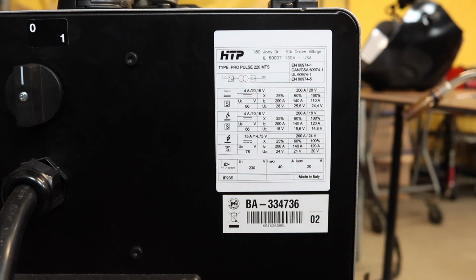And then with duty cycle, you have two things to consider. You have your initial time till the machine shuts off, where you start with a cool machine and the machine has to, by welding, build temperature up in the machine, and then later on, as you hit your shutoff, this machine monitors the temperature in 3 different spots in the machine, and once the temperature is deemed unsafe and too high, the machine shuts off for 4 minutes. It's a fixed 4 minutes, regardless of where you are, how cold or warm it is where you are, it shuts down for 4 minutes.